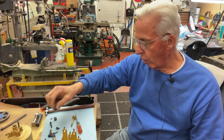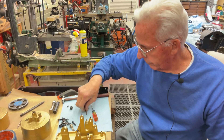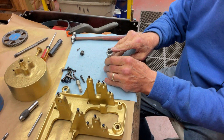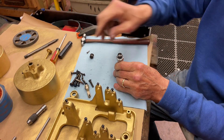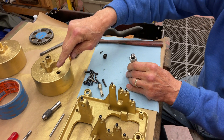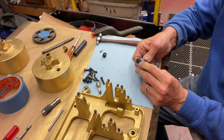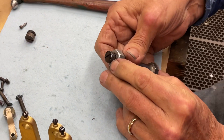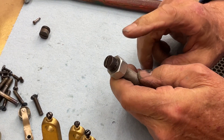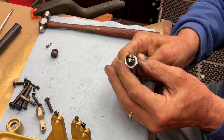I've gone through and blued all these parts. I blued this bolt — really, it's a bolt — and it fits right in here on the spring barrel. You'd unscrew this and then inject more grease into the spring to re-grease it — that's what this is for. I've cleaned all the knurling out like this before bluing, polished it all out, then re-blued it. This is a half-inch 20 nut on a half-inch 20 bolt so I can hold it when I polish out on my deburring tool.